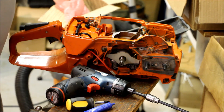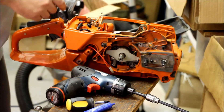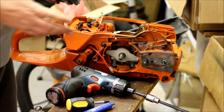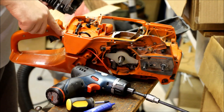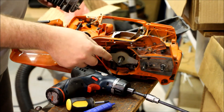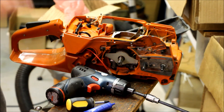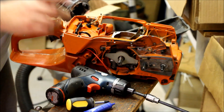Sorry this video is a little wonky, but I hope it shows how to do this. I didn't know how to do it — I had to look up diagrams, and the diagrams are not easily found. This one is very simple: from the generator to the switch, from the switch to the rear handle heat, from the rear handle heat to the front handle heat, from the front handle heat to ground. That's how it goes — just keep it nice and simple. If you have any questions, post in the comments below. Thank you for watching. Don't forget to subscribe.